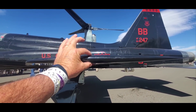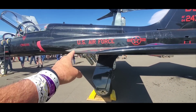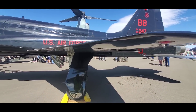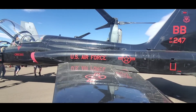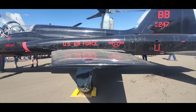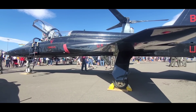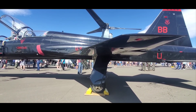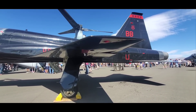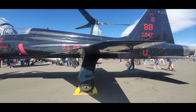Look at these real thin wings on the T-38 — that's all you get. You don't get any leading edge slats or droop at all on the original T-38. On an F-5 you do, which improves your turning performance. Your wing area is very small and your landing speeds are very high. You've got flaps on the T-38, which you normally land with, but you also practice no-flap landings. Those landing speeds can be upwards of 170 knots, and for each hundred pounds over a thousand pounds of fuel, you add another knot of airspeed onto that no-flap speed.